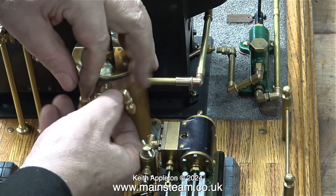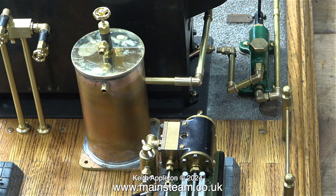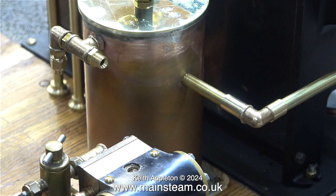Because the parts are held in place using Loctite 542 it's quite easy to break the seal. But if I'd used the green stuff like Loctite 603 I would need to heat the part to break the bond. And that is why I repeatedly mention the fact that you need to use the correct type of Loctite for different applications.